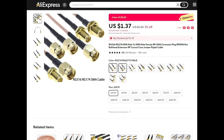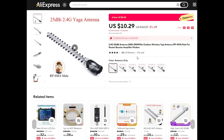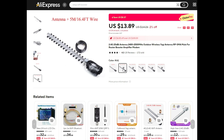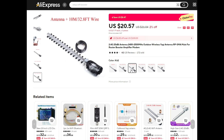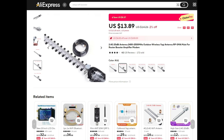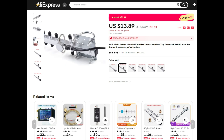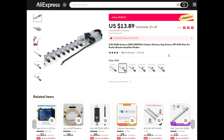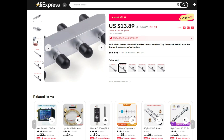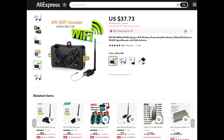You can buy them from a lot of sellers on AliExpress and they are also available on Amazon. First I tried to use a Yagi antenna, but even though it's stated to have 25 dBi, it shows the same connections as if you were using a 3 dBi antenna. I tried moving it and pointing it towards the neighborhood and other places, but the results were the same, so it was not useful.